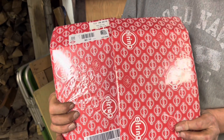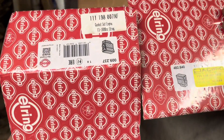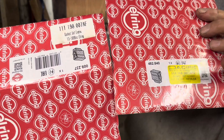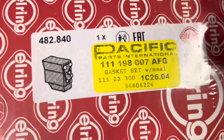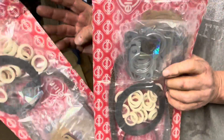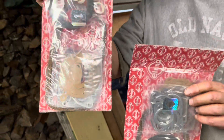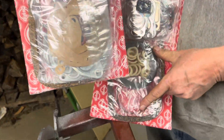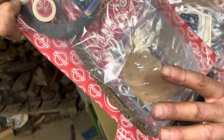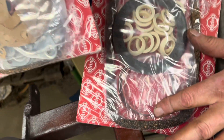I've got two gasket sets here. This is a brand I usually use — you see them everywhere. The part numbers are almost the same, but this one has a G at the end. So what's the difference? When you're shopping and you find a cheaper one, it may not include the main seal. These gasket sets are sometimes sold with the main seal separate. This particular one with the G at the end has the main seal right in it.